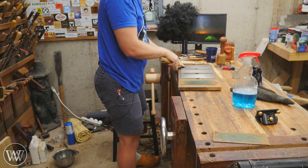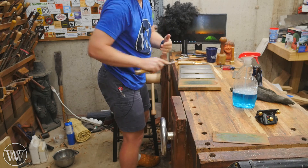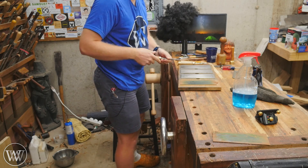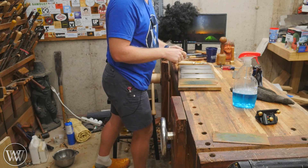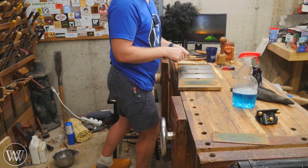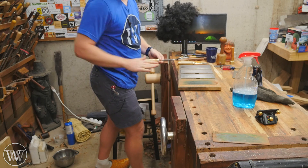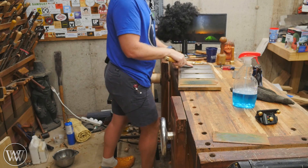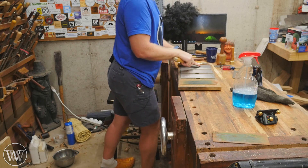When I stand here at the plate, if I just move my arm, it's going to be rocking. My fulcrum is the shoulder and I've got this rocking motion — that's going to give me a curvature in the blade. So the best method is actually to put your feet apart so you can rock from one foot to the other. You can lock your entire body together, and you notice my body is shifting so that my arm is moving perfectly in and out, not actually rounding, keeping my chisel perfectly flat on the stone.